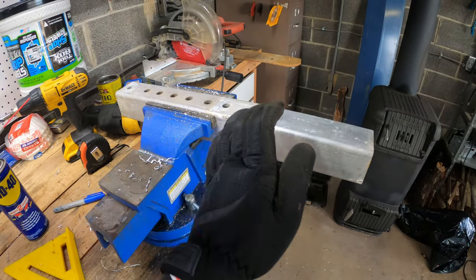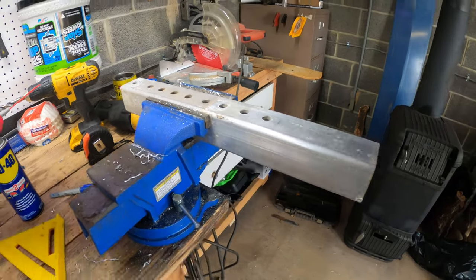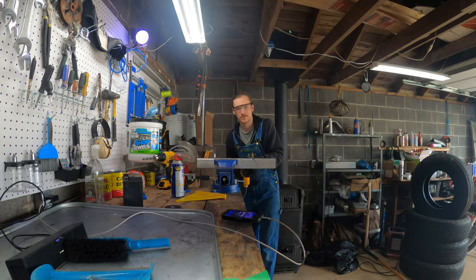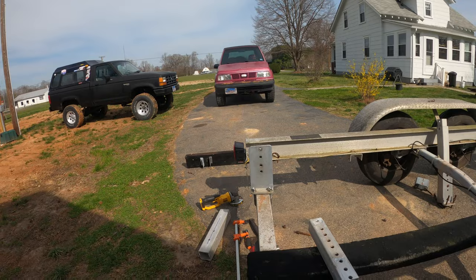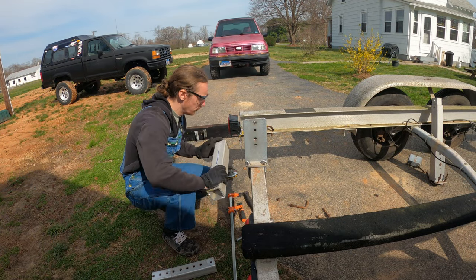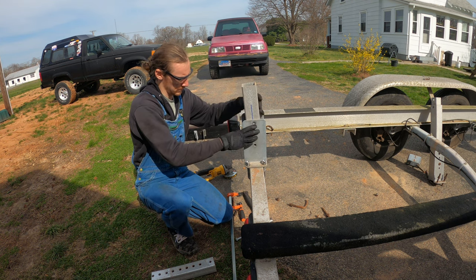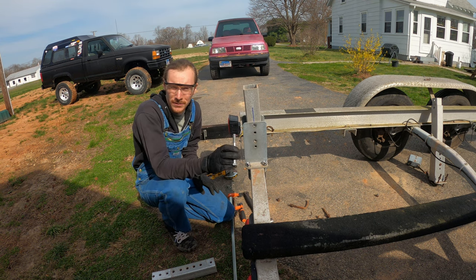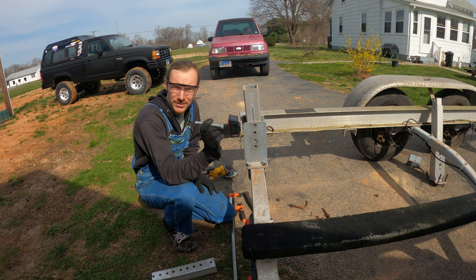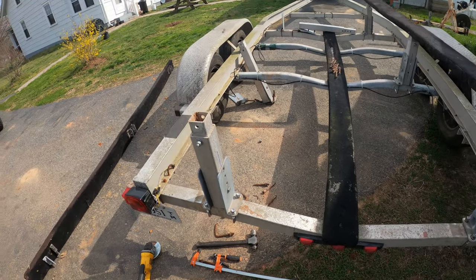And I also cut the adjuster shorter to fit down into the tube nice and tight. And then just simply bolt her back together. The correct way to put a bolt in on a boat is inboard to outboard, forward to aft. Learn it. And now just rinse and repeat two times.